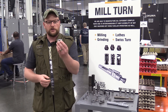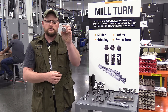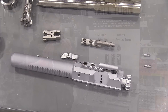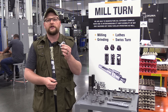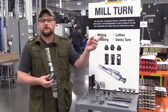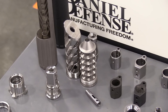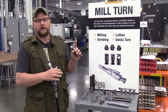Here we've got gas blocks - this one is a more intricate design with the front of the gas block and a threaded portion in the rear with a precision cut. All of those features have to be cut to a certain amount of precision. Muzzle devices and bolt carrier groups can also be done on a Swiss machine. Complex parts - even something as simple as a part for a fixture, like for the Cerakote booth or for gunsmiths in the assembly area - they can engineer, design, and manufacture those fixtures in their own facility. Baffles and similar small parts requiring precise machining in one pass can all be made on this type of machine.